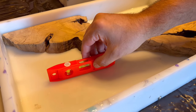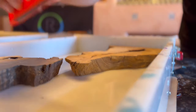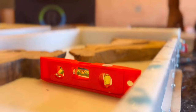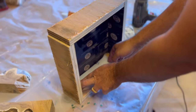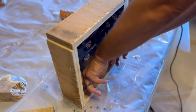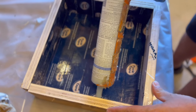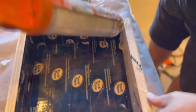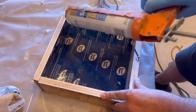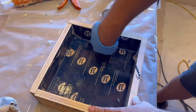It's always good to have key placement and you always want to level your molds. If the mold isn't level, the product won't be level when you're done — you'll have one side thicker than the other and you just can't have that. It's always wise to tape with sheathing tape; I use Tyvek, I use Sure Tape — even packing tape works. Make sure you get beads of silicone on every joint, nook, and cranny on that form.